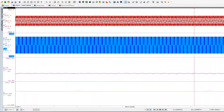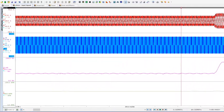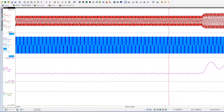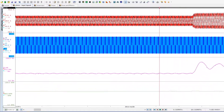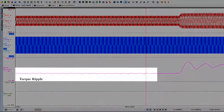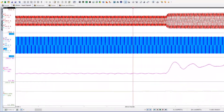The eDrive system can display and record the full bandwidth of the torque sensor and electrical signals. Time alignment of these signals makes for a very simple visualization of the measured parameters, allowing users to make decisions quickly. Notice the small torque ripple caused by the motor construction — this shows the high accuracy and bandwidth of the torque measurement.